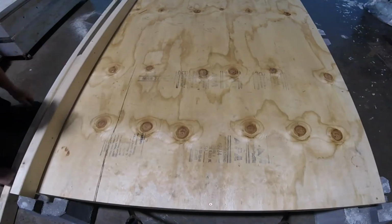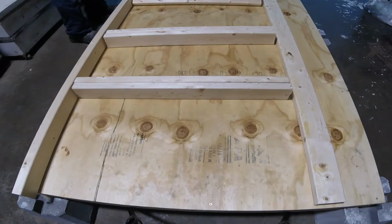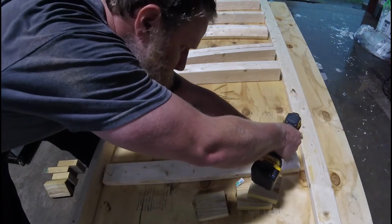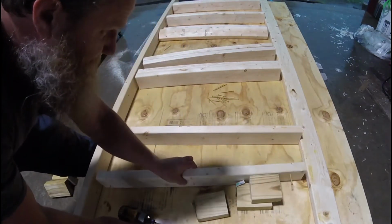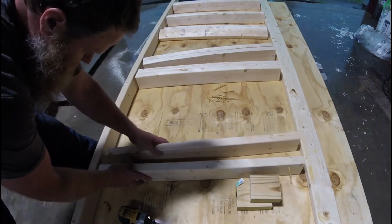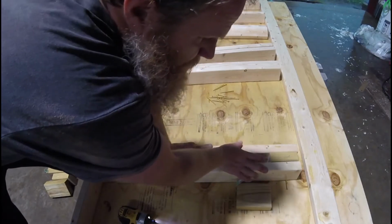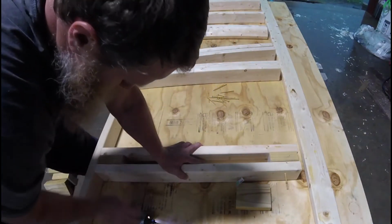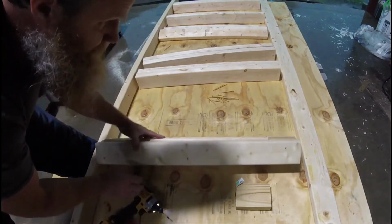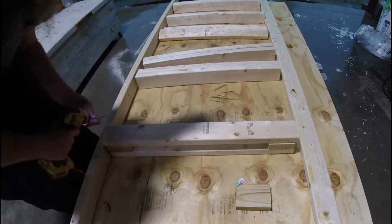So after we finish screwing the base down, here you can see us cutting or laying out the wall. I started to build a conventional corner piece, but I think it was more than what we needed for a doghouse build, so I ended up just sandwiching two 2x4s together with some 2x4 cuts in between, and it allowed for a good enough corner where we were able to still connect the walls together. You'll see that later in the video. You'll actually see where the walls actually tied into each other.